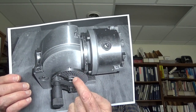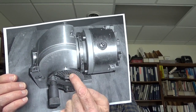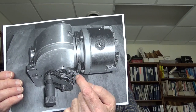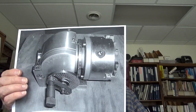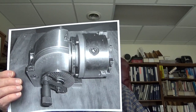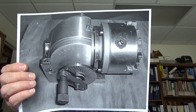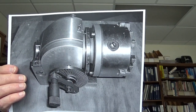and behind this crank is a plate with lots of holes in it. There are circles of holes with different hole counts, and in principle, by choosing the right plate and the right circle of holes, you could make just about any gear. And of course there are a few exceptions, and about 3 of those exceptions end up in the list of gears I have to make, but I could have made another plate with a different number of holes in it and accomplished the same thing, and so it was certainly doable with this kind of device.